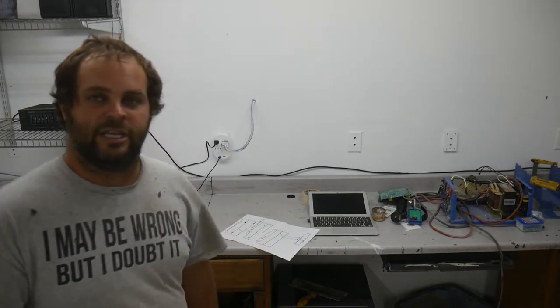We'll actually see what it does. But it drops the voltage down significantly, causes a voltage sag, and that allows whatever you're trying to start to come up to speed without pulling an astronomical 100 amps or something like that, trying to start up an air conditioner compressor. And you've got to keep in mind that this is something that probably would happen over a tenth of a second, just a few cycles, when the locked rotor amps of an air conditioner compressor would make a few revolutions, start coming up to speed, and the current would drop very quickly. An inverter like a high frequency would trip instantly, trying to start something like that.